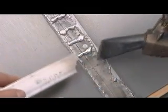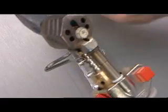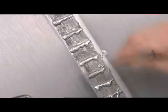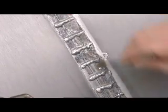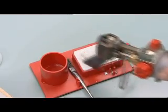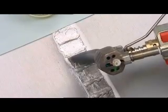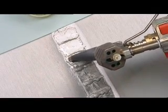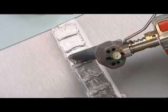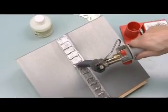If your Express iron is too hot, the soldering metal will be too liquid and could burn the zinc. If your Express iron is too cold, the soldering metal will be lumpy. After stripping, direct the soldering metal back up to the short horizontal line and let it cool down before moving on to solder the spot below. Repeat this operation every 15 to 20 millimetres.